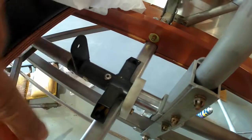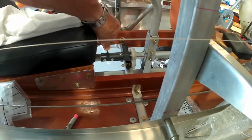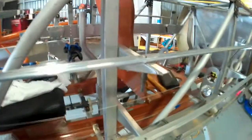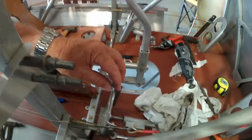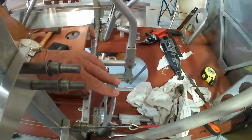The aileron control rods come out here and go out each side of the aeroplane. Again, you're going to have to step over those to hop in. You do have a little bit of room to move with the seat — I can move aft, I can't really move forward very much or we'll run into a problem with the aileron pushrods having somewhere to go. So what do you do if you're a short pilot? Well, the only option you've got left then is to move the aft rudder pedals a little bit further aft.